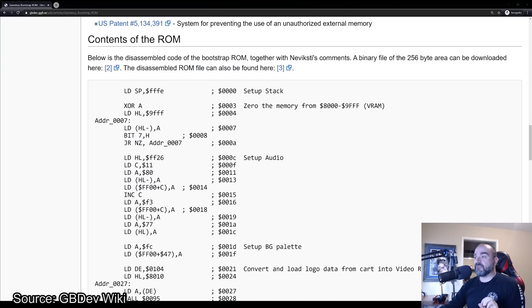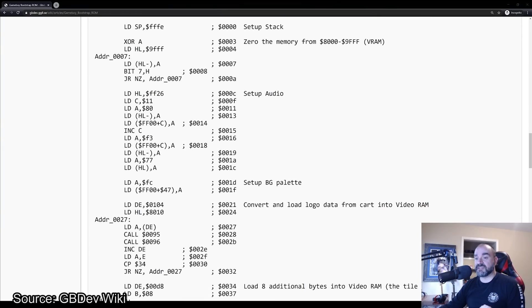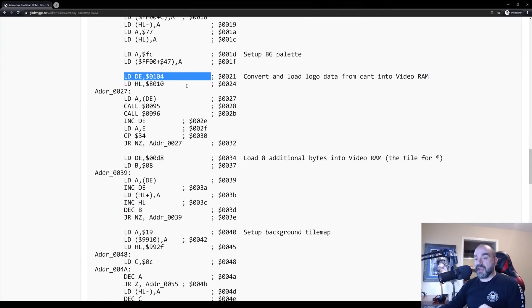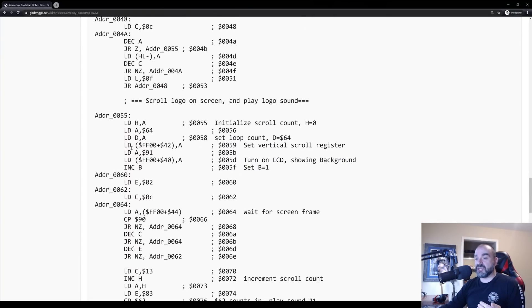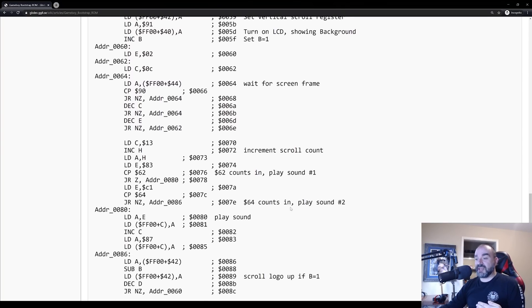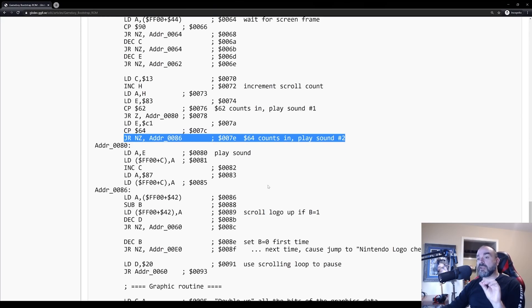What we're looking at here is the 256 bytes of the boot ROM, which has been disassembled. I'll walk you through some of the important things going on here. At address location 7, this line is loading the logo data from the cartridge — we said it was at address hexadecimal 104 — and preparing it for display into video RAM. So essentially it's grabbing the logo. Scrolling down, you can see it's loading up the Nintendo logo and getting it ready to be displayed on screen. This is where we're changing the vertical scroll registers in a loop, basically looping and incrementing the logo down the screen until it gets to the middle. Once it hits the middle, one of two sound effects gets played — there are actually two sounds, very close to each other. So that is where the logo gets used in the boot ROM.